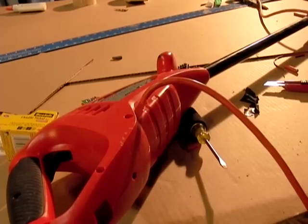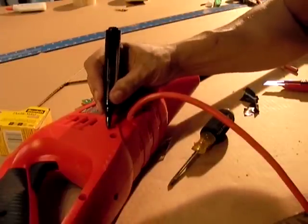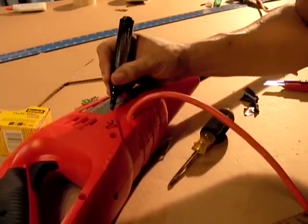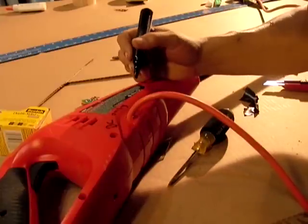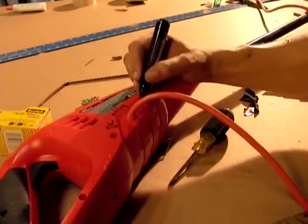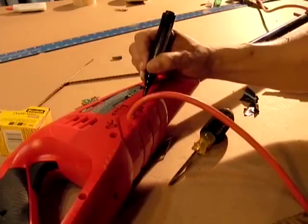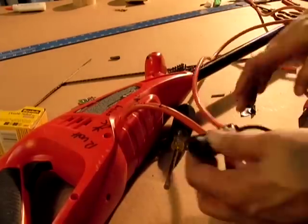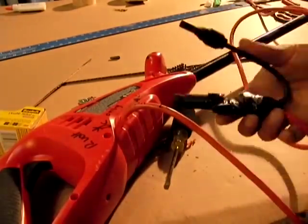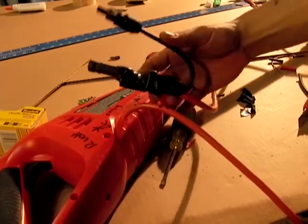This is very important. Dan clearly marked the extension cord wire and the weed eater: 12 volt, not 120 volt. It is not generally a good idea to use an AC extension cord for DC power because someone may try to splice a household 120 volt plug on the unit. So mark it well. Dan also added solar MC connectors, making this as close to idiot proof as possible.